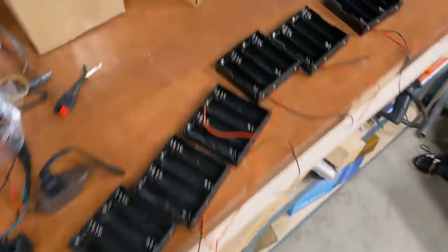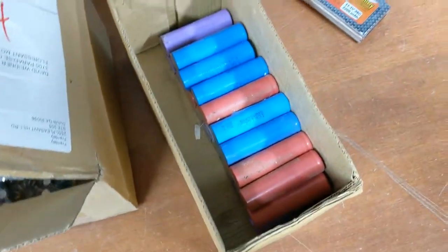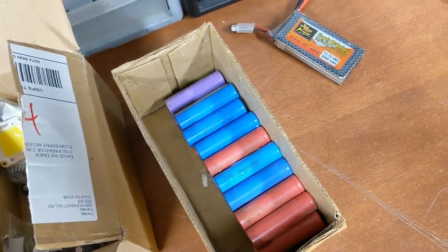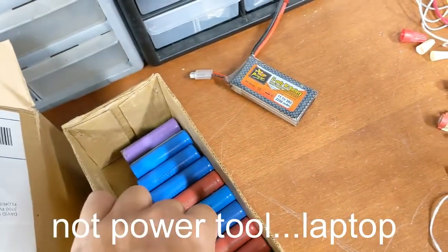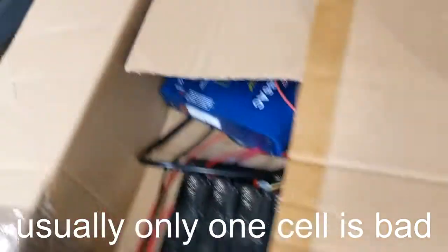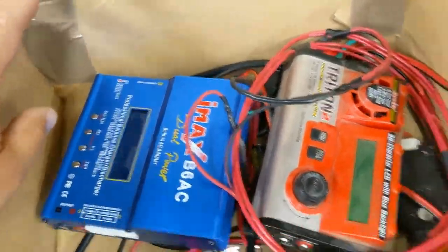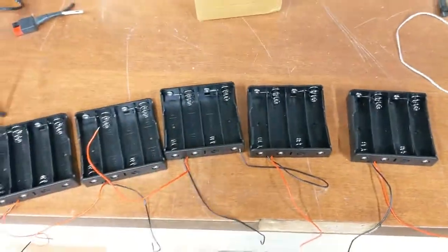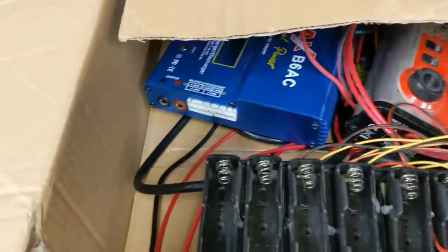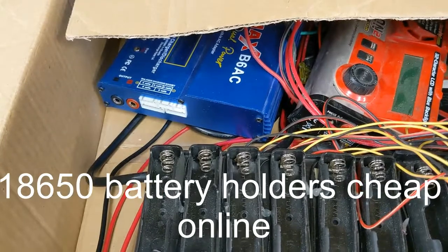This little fellow wouldn't last very long, but go to Batteries Plus, ask them if you can have their power tool dead batteries that people turn in. You rip them apart, you remove the individual LiPo cells. Get on eBay, get a cheap LiPo charger, like one of these fellas in here. They're cheap nowadays. I'm going to wire these in with a lead to each individual cell, so you can use a smart charger like these I just showed you. I gotta make a weatherproof plug. That's the only tricky bit.